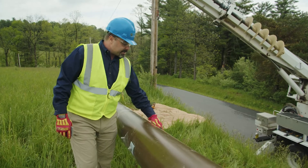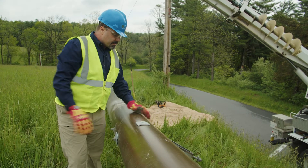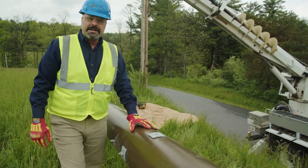Bedford Rural Electric is attaching this bracket to the fiberglass pole, and they're using the correct washer. It's a smaller radius washer. There's not much of a load on this neutral, so that's the appropriate hardware you would use, and you can see how the radius matches the pole very nicely.